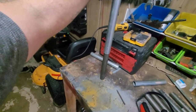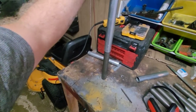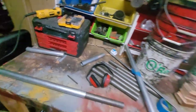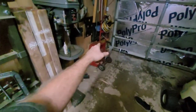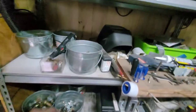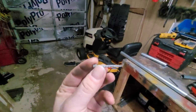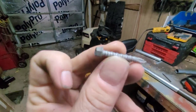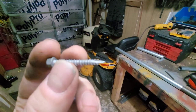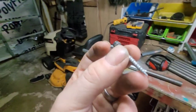I haven't figured out how I'm going to secure it yet. I'm thinking either getting my welder out there — which means longer cables — or using some sort of sheet metal screws that are self-drilling, or even drilling a little hole myself and sticking a screw through there to stabilize it. These screws here are for metal roofs and they are self-drilling, self-tapping, but I would probably drill a small hole first because you're going through quite a bit of metal.